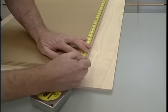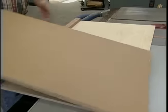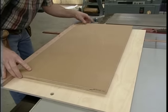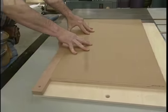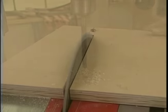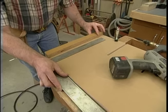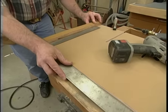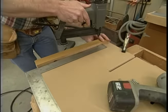I want the piece to be 28 inches long. These holes are needed for the bar clamp slot. I'm starting to cut the slots with a table saw and I'll finish them with my handheld jigsaw. Now I can install the stop — a piece of inch-and-a-half wide, three-quarter inch plywood. And even though I know my panel is square, I'm still going to use my framing square to confirm it. Tack it with some brads and permanently attach it with some screws.